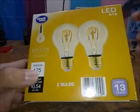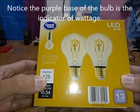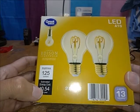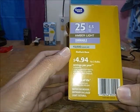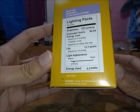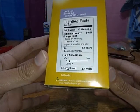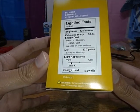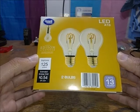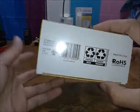As you can see, they've got this nice little design which always makes me think of a pretzel or something — it kind of has that shape to it. They have 125 lumens and about 4.5 watts, which is a 25-watt equivalent. They are dimmable, 2175 Kelvin, and last for about 13.7 years based on three hours a day of usage. These are standard A19 style and use the medium base, or E26 screw base.